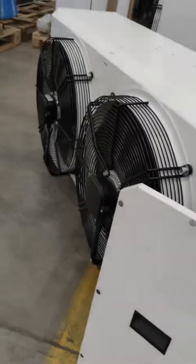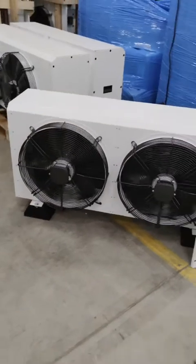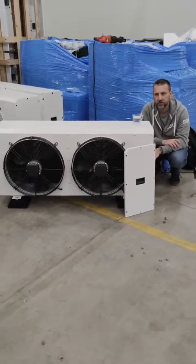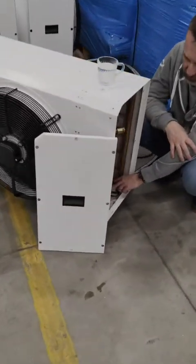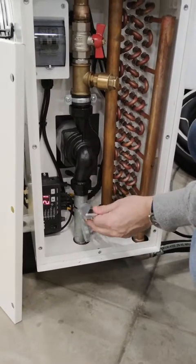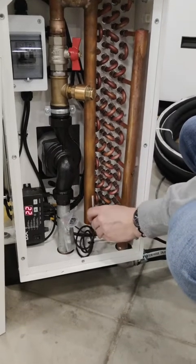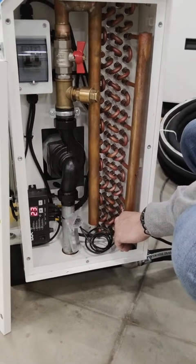Normally we use different fans. Right now we use the standard fans. We are changing that product to industrial tilt-back fans, which are so much better — there is literally no noise when the speed of the fan is reduced or slowed down. The temperature sensor feeds the adaptive fan controller, taking the temperature from the sensor, which is normally attached on the outlet manifold or on the inlet manifold, depending on the configuration for each customer.